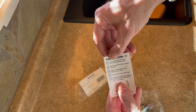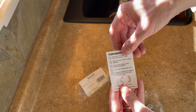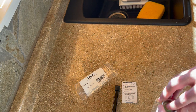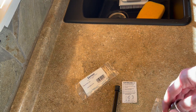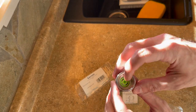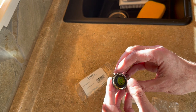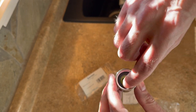You can see the instructions on the back — that's step one. Step two is you've got to do it right. Step three: place in the fitting as seen below, ensure a tight fit. So I chose the 4 gallon per minute option, placed it in there — it snaps right in. And then there's a rubber washer that'll give you a tight seal against the water heater. Now I should be ready to install this in the water heater.